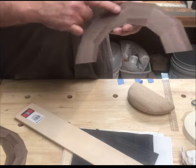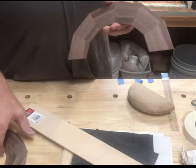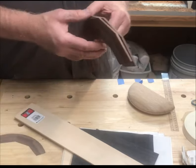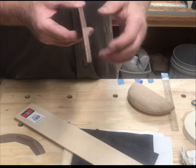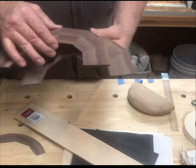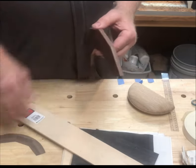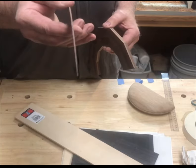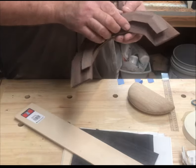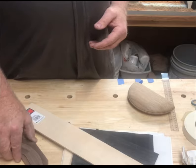And so I glued up this walnut. You can see it's just segmented pieces of walnut. It was 3/4 inch thick after I glued it up. And then I took it to the bandsaw and resawed it, and I got 3 pieces out of it. And then I was able to run it through my drum sander and sand it down to about 1/8 inch. This one, I actually cut a little bit thinner. And this one is the one that I cut the veneer for that vase that I showed you earlier, that split bowl made out of cherry that I showed you earlier.